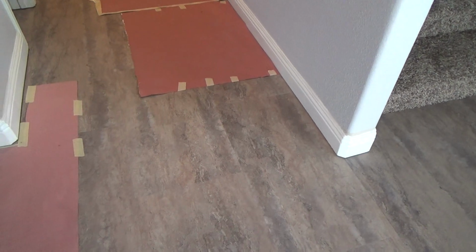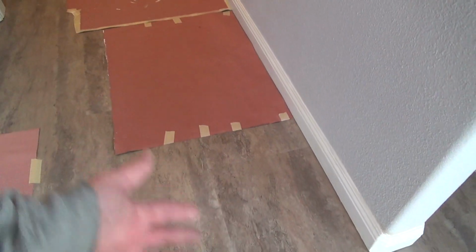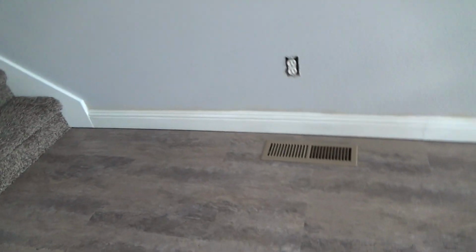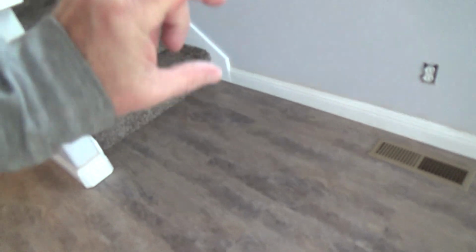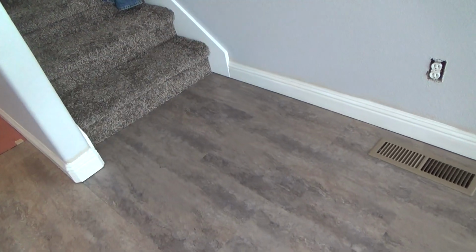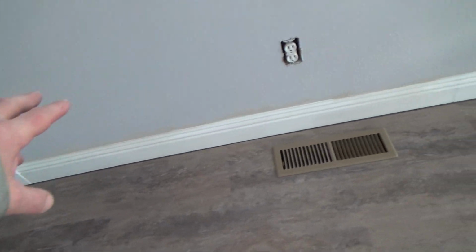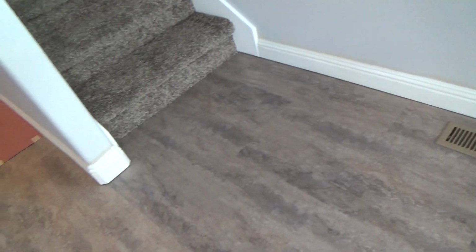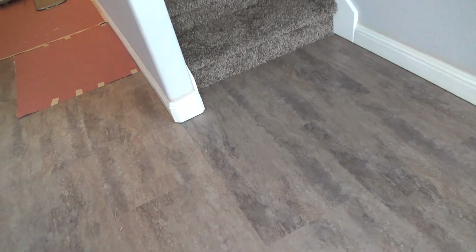But either way, as long as I get the paint down next to the baseboard, down next to the floor, if I get it down there a quarter inch, let's say, from the floor, does it make sense that I don't necessarily have to cut the baseboard in exactly down to the floor, do I? Because there's a gap there. And because I know I'll use at least 5/8 or 3/4 quarter round, so if that is up off the floor, quarter inch, 3/8, whatever, as long as I'm within a quarter inch from the floor, I should be okay, shouldn't I?